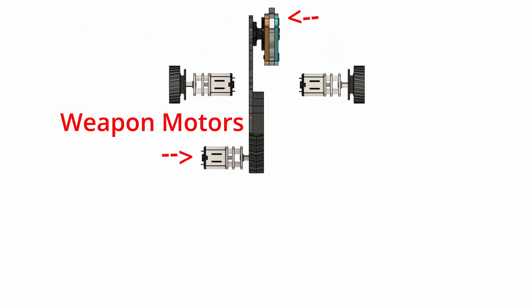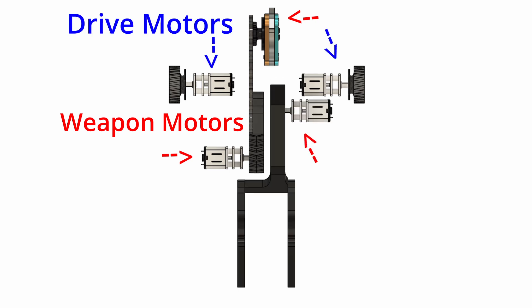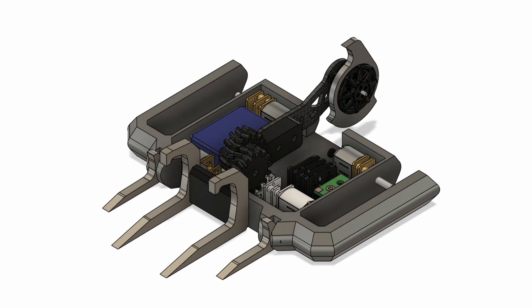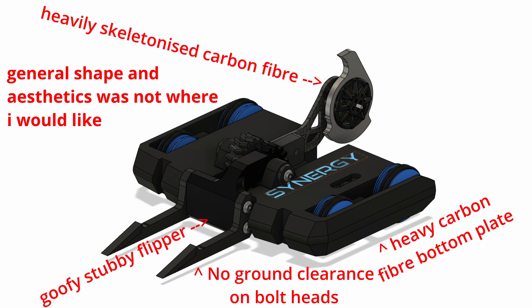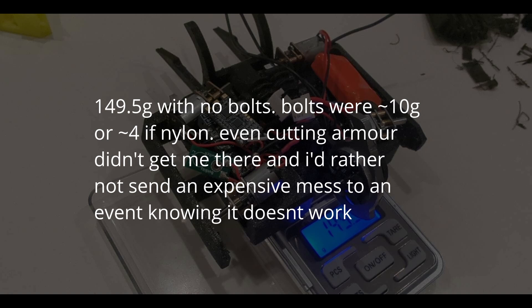The issue here is that on top of drive systems, hammersaws are unique in having two weapon actuators where a standard bot has one, and adding a third in the form of a flipper brings us to a final count of five motors as opposed to the normal two or three, all while remaining under the unforgiving antweight limit of 150g. In fact, the first version I ever made never even made weight, featuring a lot of design issues as my experience of only ever building a big horizontal spinner didn't translate well to designing a control bot. I did however get just close enough to making weight that I thought with a complete redesign, I could get this to work.